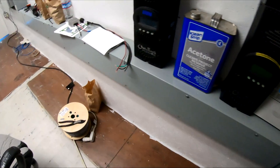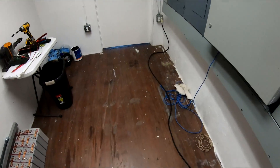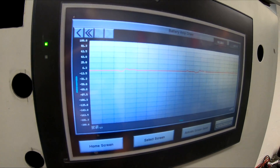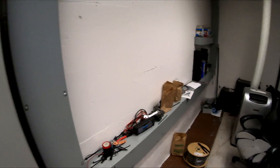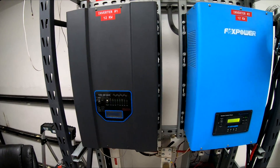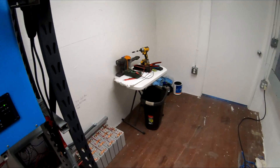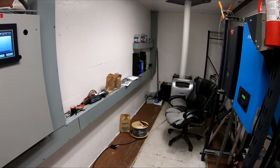We're pretty much set there. I have another spool of PV wire I'll be using to make those extension cords. We can go into our HMI panel and go on the battery current graph. Right now we're not really doing much of anything on the battery graph, but if this were drawing or adding, you'd see that shown on there. When the spa is turning on to divert excess power, it's using this inverter. This one's running 52% load right now — this is a 12-kilowatt inverter — and that's running this AC and the AC in my parents' RV. All in all, the system's running pretty awesome. I'm glad I got those solar panels in.